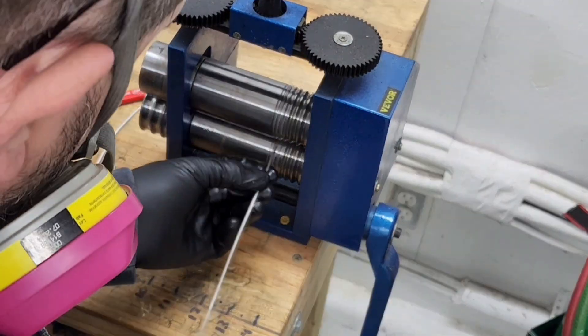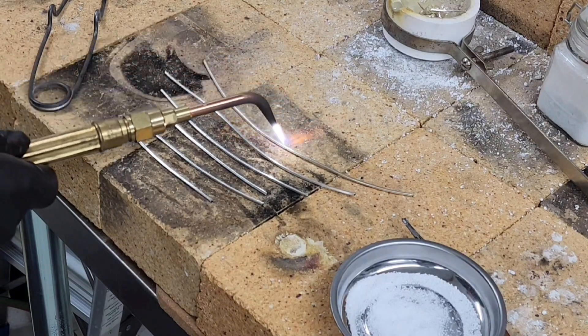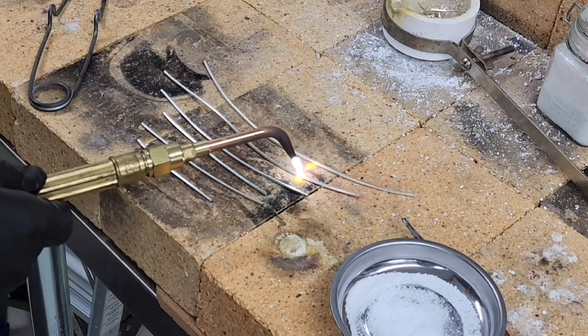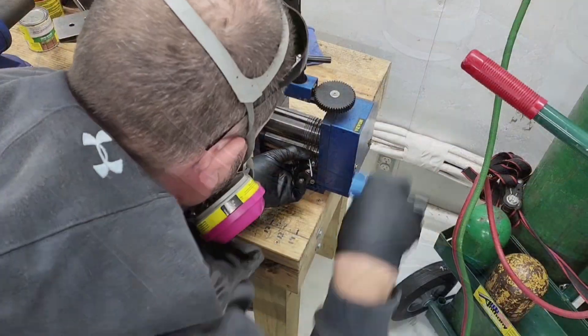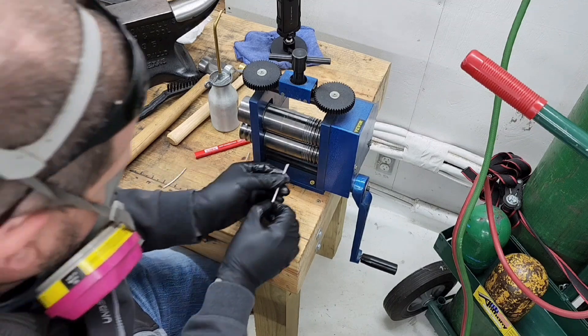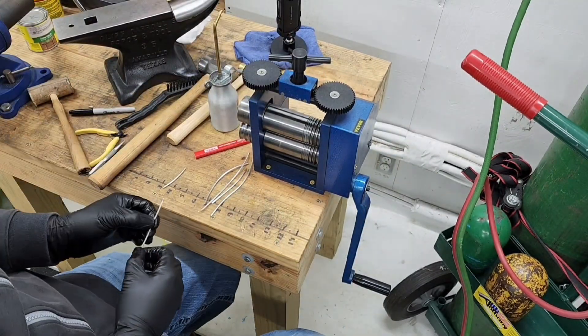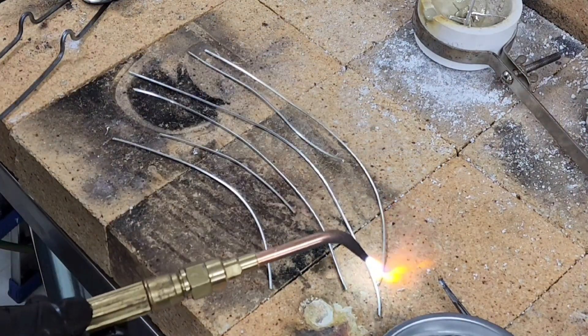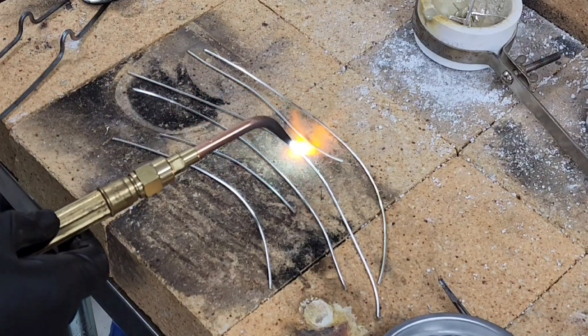As you're sending them through, you can get about two 360-degree turns out of the mill before you have to re-anneal them. This is the annealing process — you literally take the torch and heat them up until they're really hot. There's a trick to annealing: you can mark them with a sharpie, and once the torch makes the sharpie disappear, that's pretty much hot enough to consider it annealed. Once you anneal, you always quench — I quench in a pickle solution, though you can quench in water too.